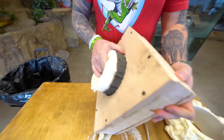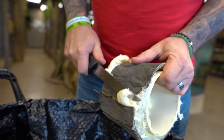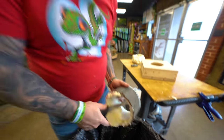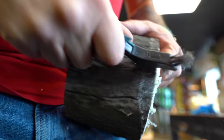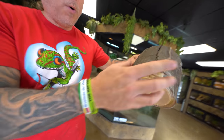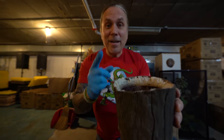Can we get this out of the mold? Looks like it's actually not too bad. This stuff expands a lot, and it came out. Obviously all that expansion right there — what we're going to do is first just take all this foam off here. Basically it's just a matter of doing a lot of cleaning up all around here. Comes off pretty easy. Start to see it's taking a little shape now. Get all the foam off the actual coupling itself, because we are going to paint that. Then you can take a little wire brush and just wire brush all this stuff off. The cup just fits right in here like that, so now you can actually remove the cup — you can recycle it, buy new ones, wash them. Before we get onto the seaming, I'm going to show you that this white inside here — we want to actually color with some spray paint. You're going to see through the clear plastic cups and see the white. We don't want to see that, so just going to do a quick spray to hide all of the white.